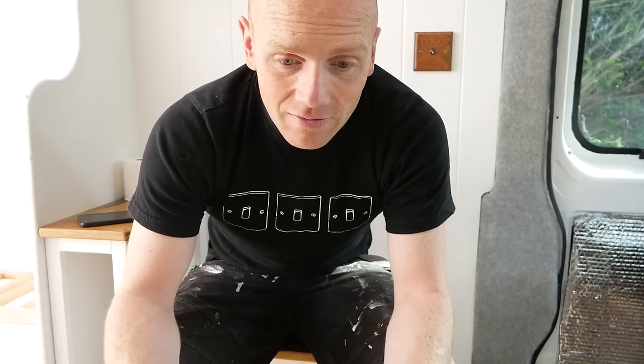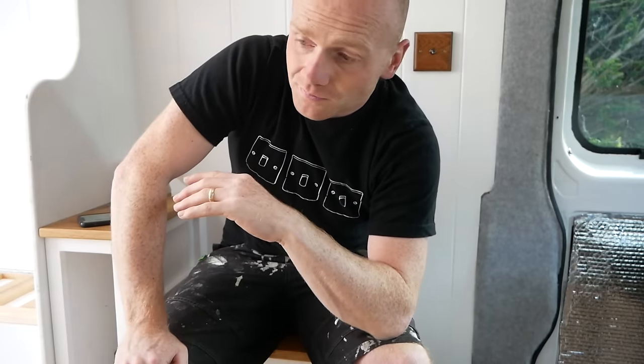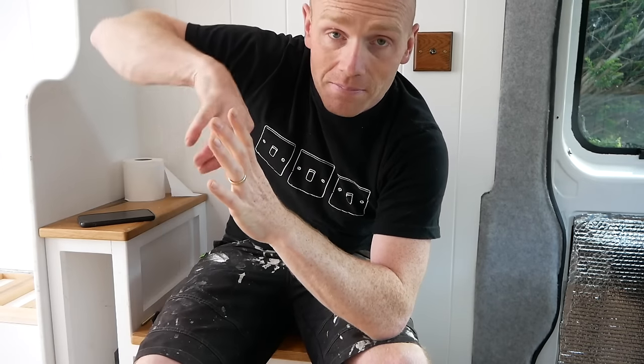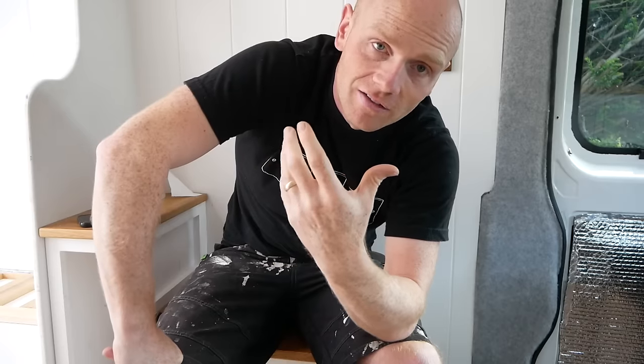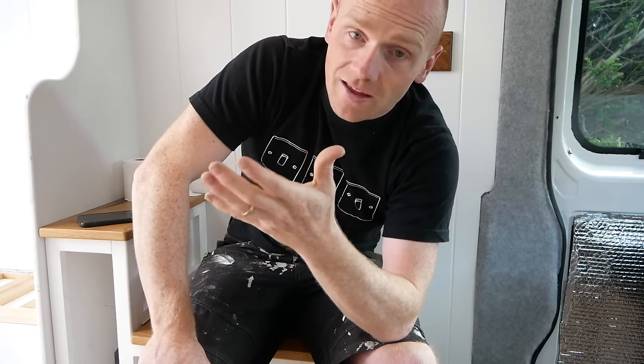I was learning along the way, but the key thing is keep the wall as damp as possible. The nature of lime is to absorb water and then release it again, but if you put your nice mortar in there it sucks the moisture out. You can see immediately where you haven't had it wet enough — it just dries, becomes crumbly, and there's no point leaving it in. You just have to rake it out and start again, so it's better to get it right first time.